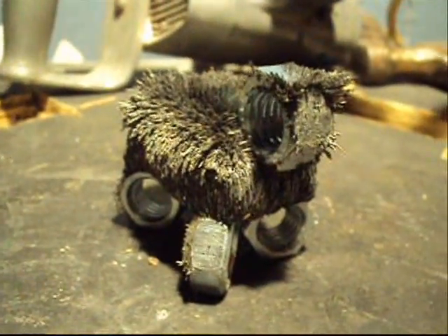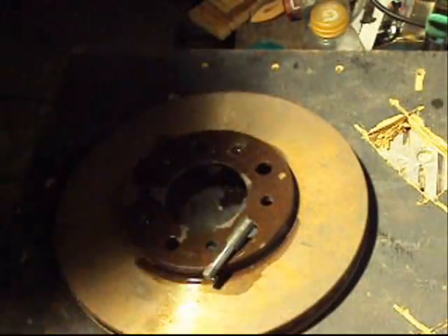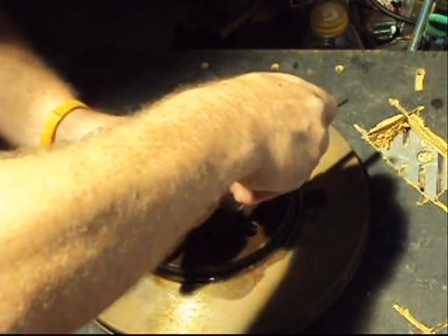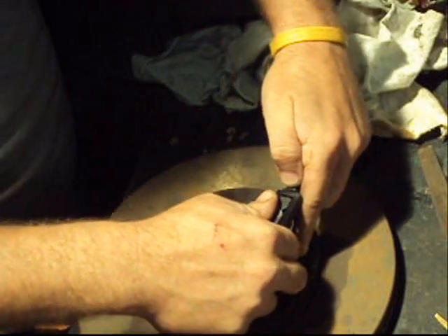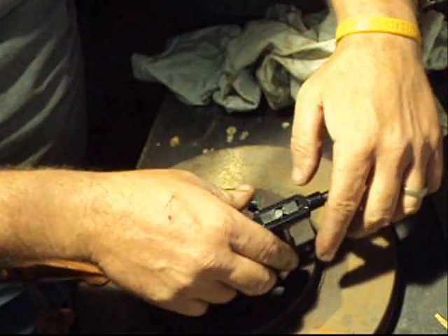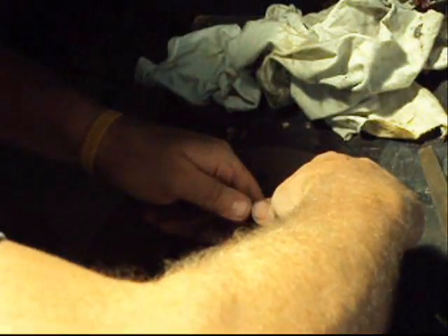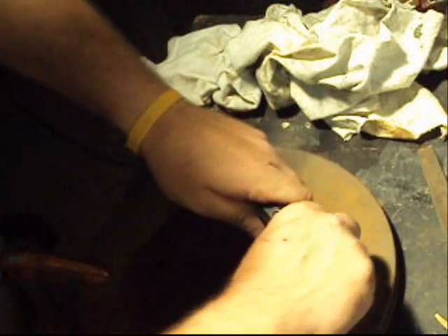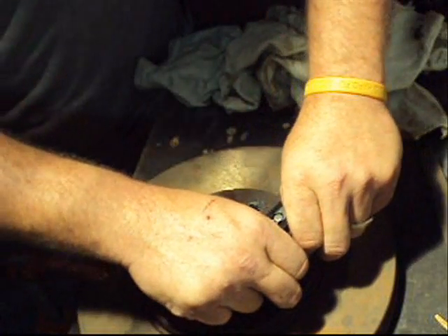There's the second hole — that's a lot of metal dust. I've got plenty of oil all over everything, including the tap. Tighten this up and we're ready to go. First, doesn't want to take at first — just kind of have to give it a hand. It's nice to have a tap and die; sometimes starting these holes is a little bit hard. You've got to be careful to keep this thing exactly straight up and down. I think we've actually got one thread in — almost a thread. There we go, it's starting to grab.